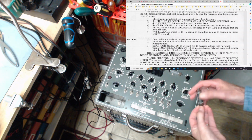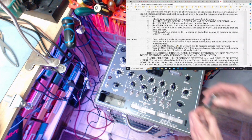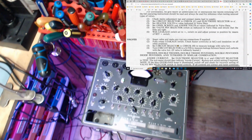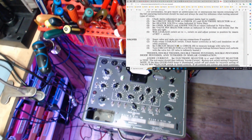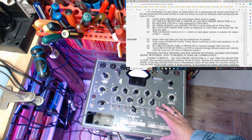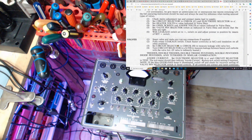Let me take the one in the tube tester. Definitely did not get warm. And let's put the power on here. Let me just move back a little. No, go forward. It's very hard for you to see this. On the dial, looking for shorts. None, according to this. And see, the tube tests perfectly good. It's a very good tube. So there's no doubt the heater heated up in that tube tester. You probably can't see it in there, but it definitely did.